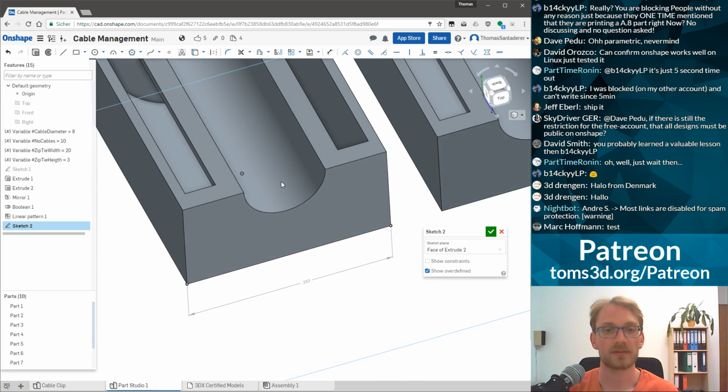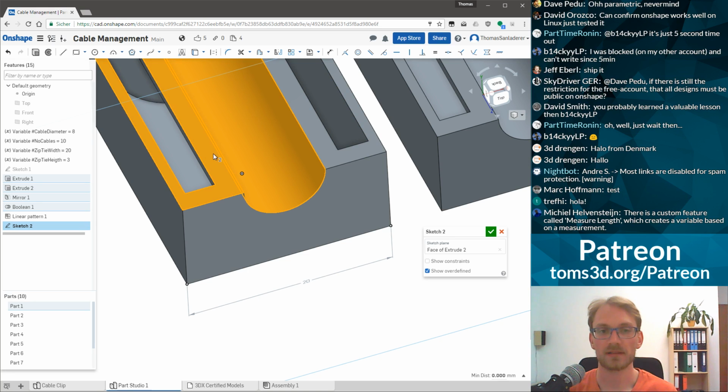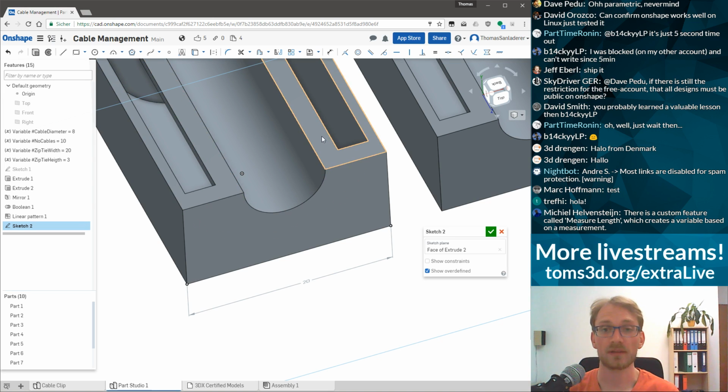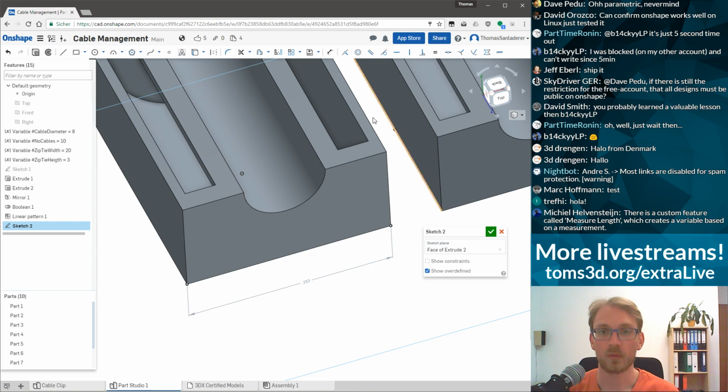How does that combine? So it's the cable diameter, it is the thickness right here between the zip tie, Velcro strap, and the cable, so that's twice. Then we have the width, or depth, width, height. Okay, height of these parts twice, and we have that millimeter gap. So we have a fixed width of 1, 2, 4, 6 millimeters, plus cable diameter, plus twice the zip tie height.